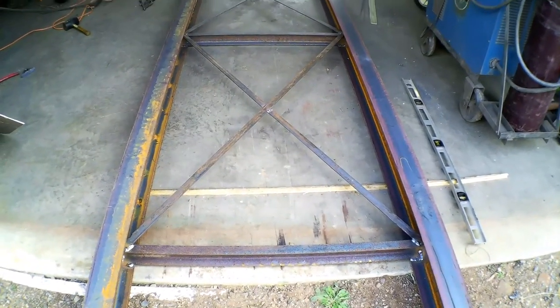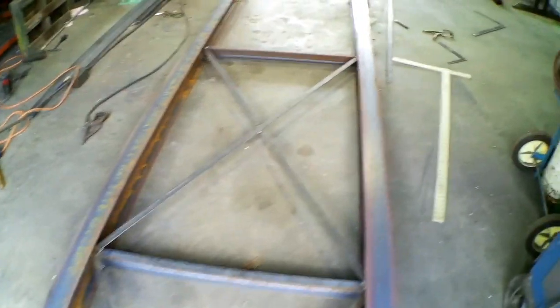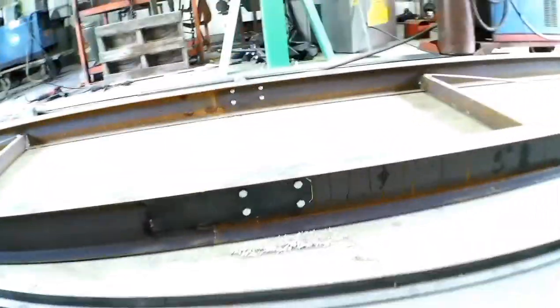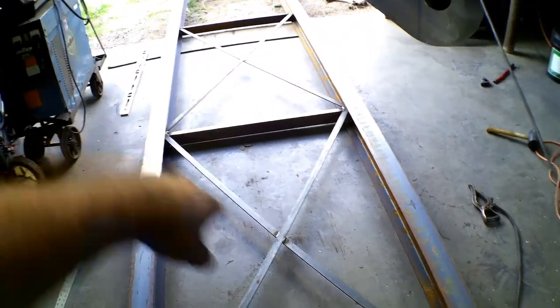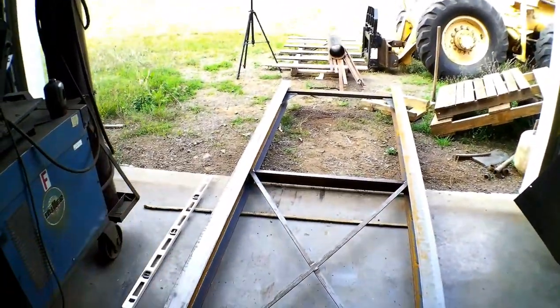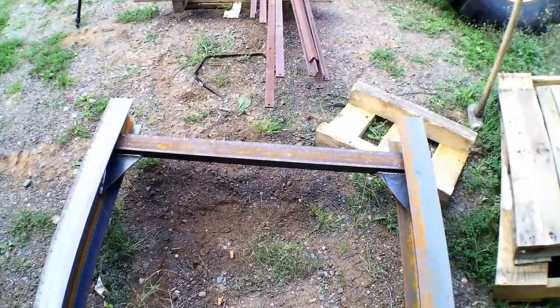These are spaced out with three inch channel, and then these flat bars kind of hold everything together, tie it together so it can't move. We started in the middle and welded on a gusset plate. Hopefully you can see this — there's a gusset plate down there with four bolt holes, and that's what holds these together and holds them true. So this can be removed; it can be taken apart. Then we started on the north end, welded in the first spacer, welded in the second spacer, ran the X of the flat bar across to keep it true, lined everything up again, welded in the next one, and so on. Finished it off the end with channel in this configuration with gusset plates.